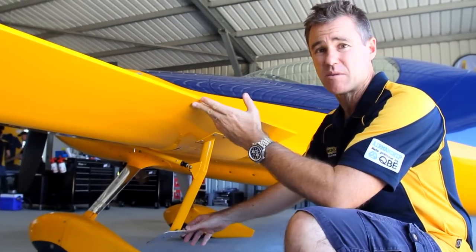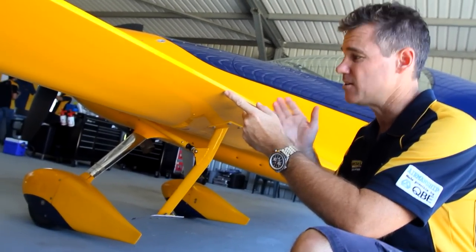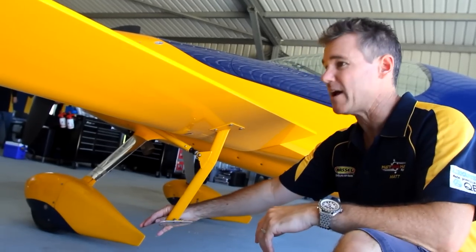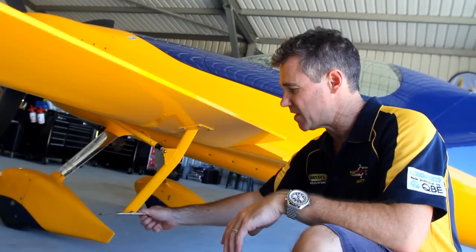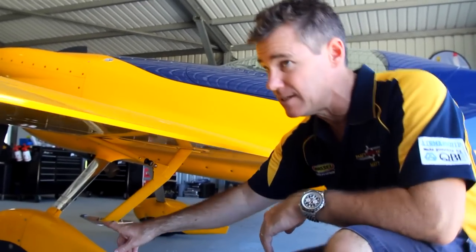Now this is an aerodynamic balance. It's kind of like aerodynamic power steering, so that when I'm trying to stick the aileron up in the air, you can imagine that creates a lot of effort in the stick. But the air then hits this and pulls backwards and assists that level of pressure on the stick. So that's how we can quickly maneuver the stick even at high speeds, at over 200 knots.